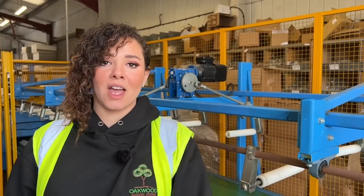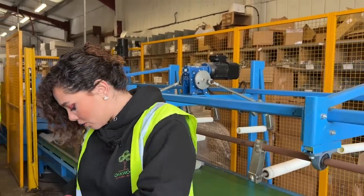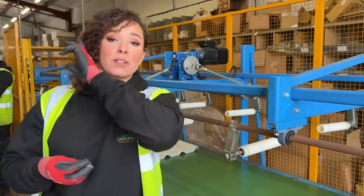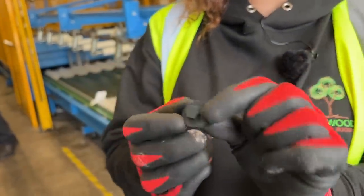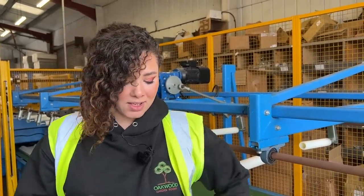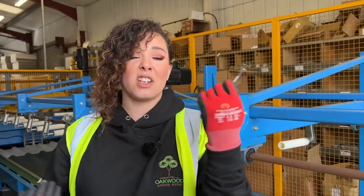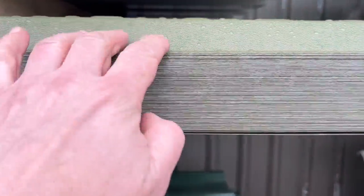This is what we use for the back of buildings - it's no-maintenance cladding with ridges to help airflow. We used to use tech screws with colour-coded caps on the outside, but they didn't finish the best. Instead we now use anthracite rivets which you can also get from here - it gives a better finish, you can seal each piece together, and it just looks nicer. There's plastic-coated steel and also a poly coat finish which doesn't scratch up as readily.